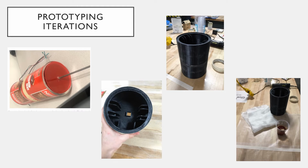We began by demonstrating that the idea of a push-pull actuator would be ideal in the situation of having dual samples. The actuator chosen was a solenoid, which functions best at low temperatures, which was ideal due to the location of the capsule and having it function with low usage of power.